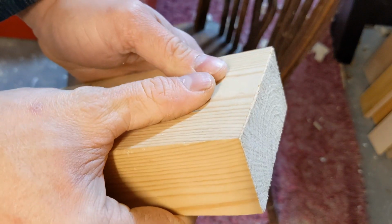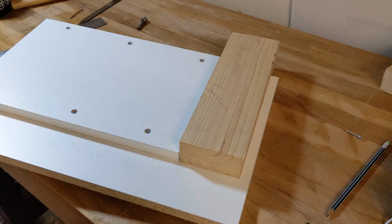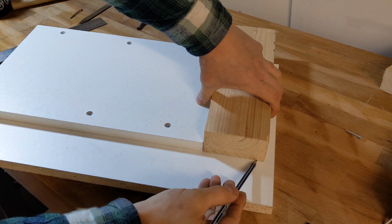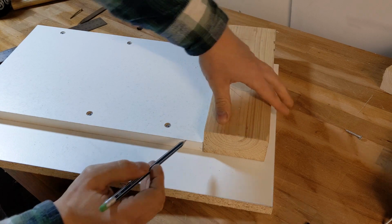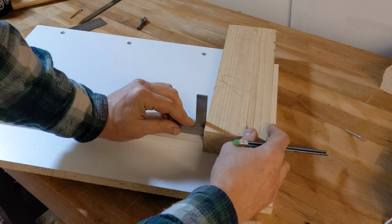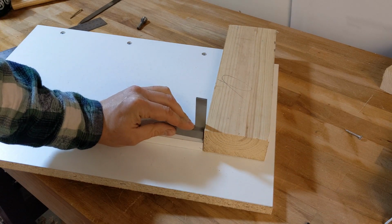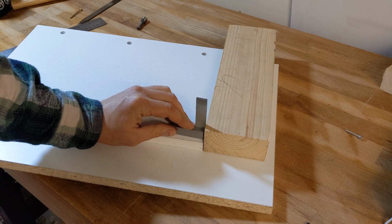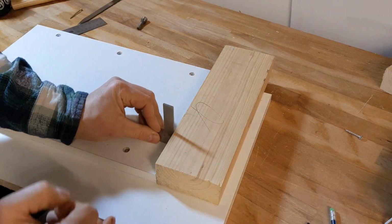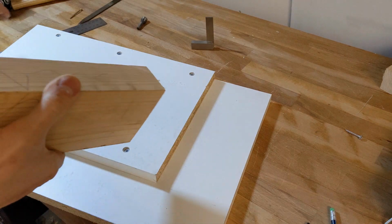That knife edge left around is kind of what you want to see, and we can tidy that up with a plane. So back to discuss what's important. We want to make sure that it's dead flat, and that it's going to be meeting up and be dead square as it comes off of that board. To judge that, you just want to rely on natural light. Hold your board up to the light and just eye it through, and we want to make sure that that edge is nice and square.